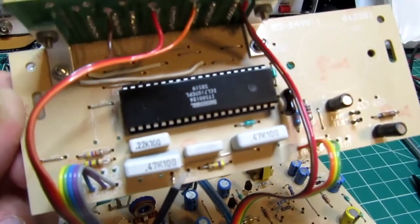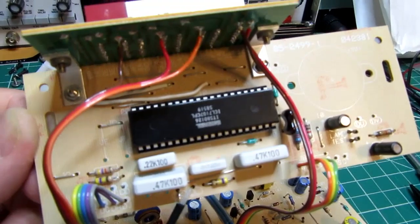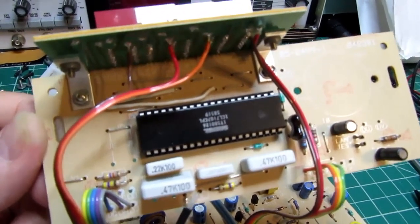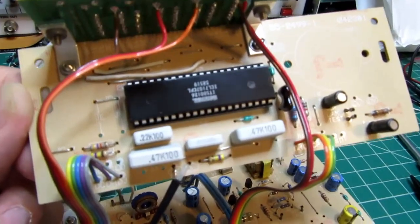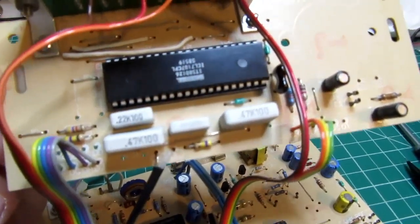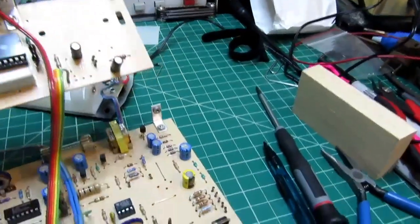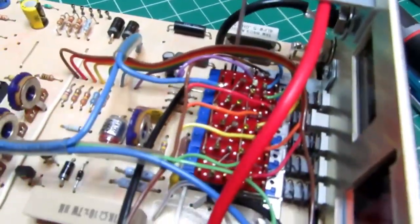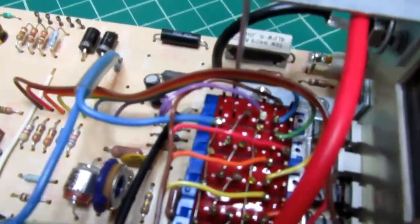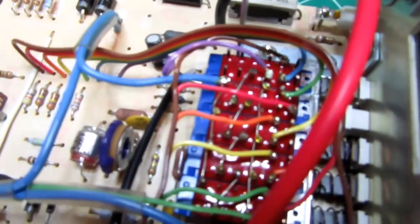In this Heathkit circuit, it's a little simpler than that. The reference input is just held to one of a couple of different fixed reference voltages, and all of the signals for measurement are being fed dynamically into the regular differential input. Okay, so much for that. Here you have all of the switches for functions here and ranges there. The pins on the switches go through into the circuit board and make some connections, and then additional connections are made on the top by direct point-to-point wiring, jumpers, and ribbon cables coming off.